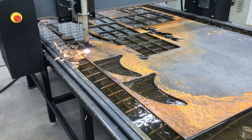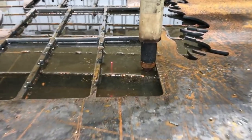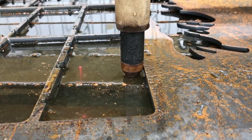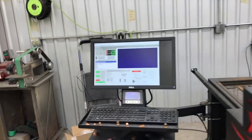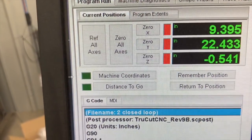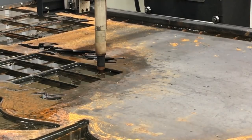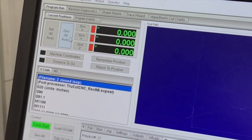What you want to do is get to a known reference point. In this case I'm using the shield on the torch — we know that's 992 thousandths total diameter. So if we want to cut that in half, it would be 496 thousandths. What we do is zero out our DRO, then raise our torch up just above the plate — doesn't matter how high — and then jog over 496 thousandths.